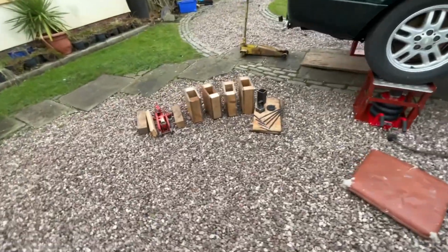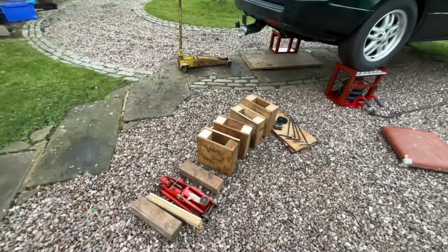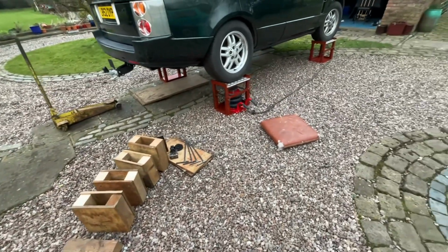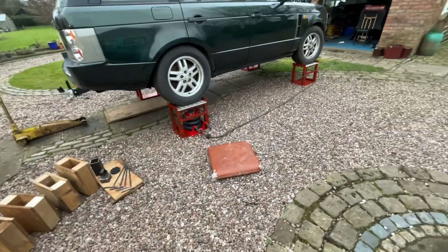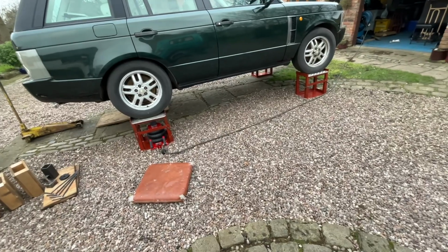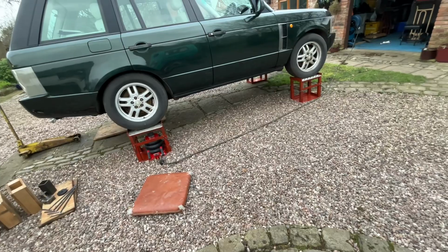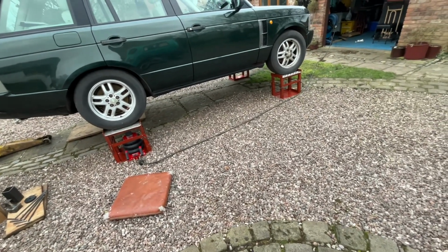So I've needed to make these intermediate chocks so they stand under the wheels, and then using further jacks to lift the whole thing up. But once it's onto the stands, then I can raise or lower it by 4 inches or 8 inches. Overall, it will give me most probably about 28 inches of clearance, which is more than enough. And I think most probably I will only need to have it on the bottom setting, which will give me a clearance of 22 inches.